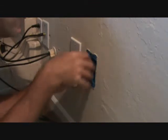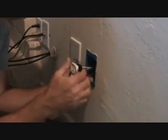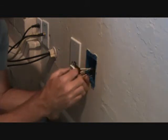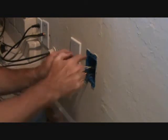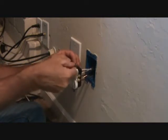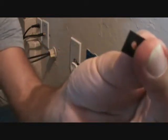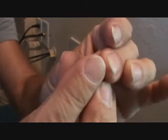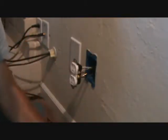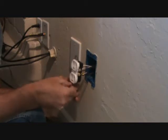Before I just cram this in here willy-nilly, I like to take these screws out because as I'm pushing it in, I want to get it all the way tight to the box. Because the wires are so short, I want to make sure I get it pushed in there properly. This is a plastic box, and if I just drive these screws right into the plastic box it could strip out, or start pulling apart. It only takes a second to pull this off. Lots of times these screws are connected with just a little plastic piece on the back side — you don't even need that little black thing at all.